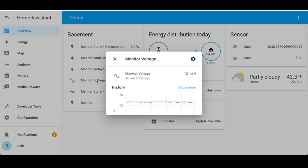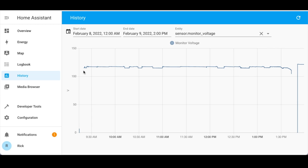Going to the voltage monitor and hitting show more, we can see the voltage over time. At 9:20 it was at 115 volts, then up to about 117 volts where it stayed most of the time — pretty steady. Then here at 1:43 it dropped down to 104 volts, which is when the battery was depleted. Over here is where I plugged it back in, so this pretty accurately told me when the unit shut off at 1:43 PM.